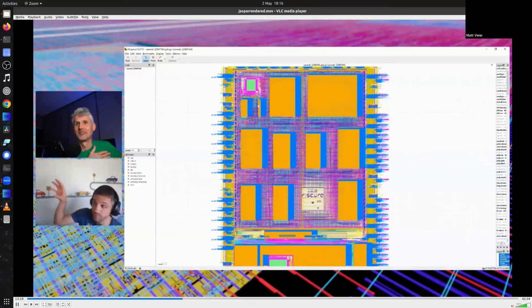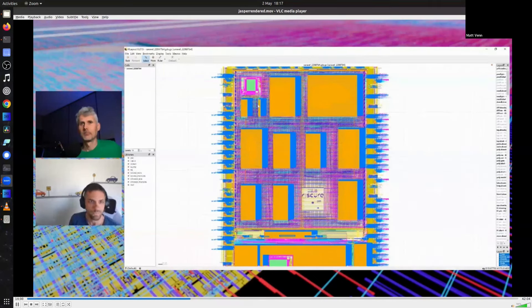We used a lot of open source here: the open-source PicoRV32 cores, open-source AES cores, and the Multi-Project Tools, which is one of Matt's projects. We opted not to use a shared bus because, being conservative first-timers, we didn't want one broken block to kill the whole system. Multi-Project Tools essentially uses a logic analyzer bit to select which core is allowed to talk on the bus.